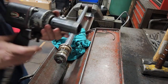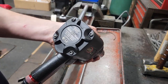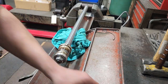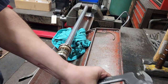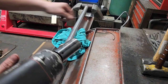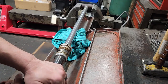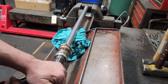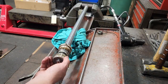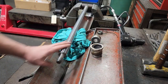I need an inch and an eighth. I got an inch and an eighth socket here on a half inch impact — Thor 1894. Again, not sponsored, but link is in the description if you decide this might work for you. I will say this is a good impact, but again, don't have to buy it. We're going to take the piston nut off. Piston nut's off. We'll slide the piston off and slide the gland off — and that's it.